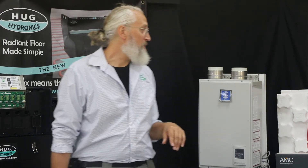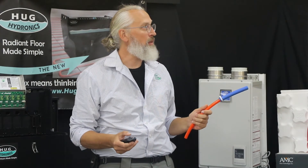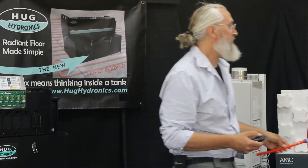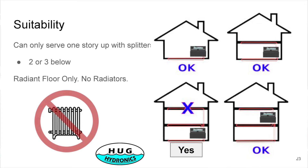The advantages are primarily simple installation. The quick connections are a big thing — we just take our blue hose, push it down over the PEX, and squeeze a little white clamp on it. That's the extent of the plumbing. However, we're not the right system for radiators, because the system runs at low pressure and oxygen can get into the system. Those big old cast iron radiators can corrode from the oxygen our system pumps into them.